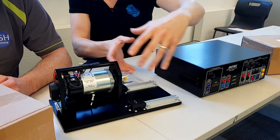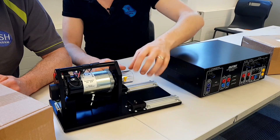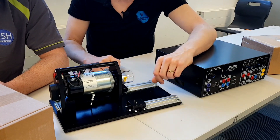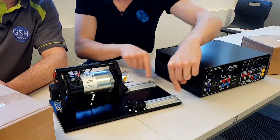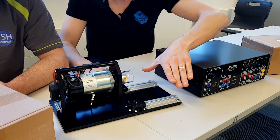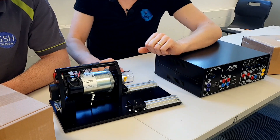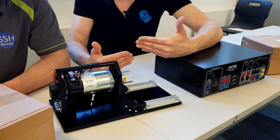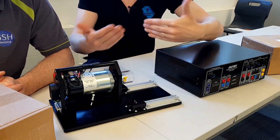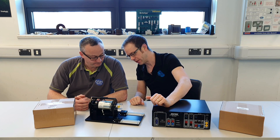And there are some lovely safety features about this as well. We're obviously going to be connecting motors to this device and you're dealing with rotating parts, which could be dangerous. So you've got this sleeve over the connecting portion there - the idea is you can never lean over it and get your tie wrapped up in there. We've also got little micro switches in here, so you slide your motor in and the motor won't operate until it locks into there. Which is pretty cool, isn't it? It's a really, really nice bit of kit and I just can't wait to actually start playing with this.